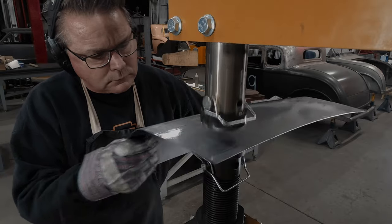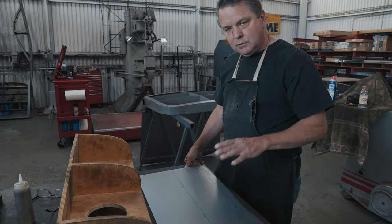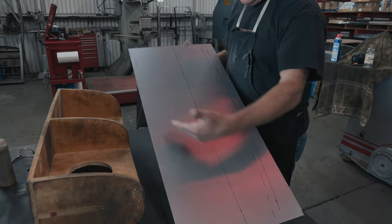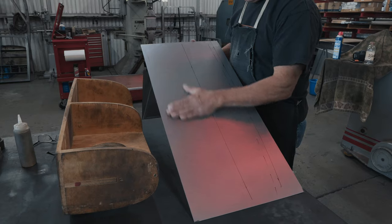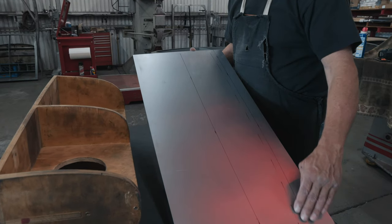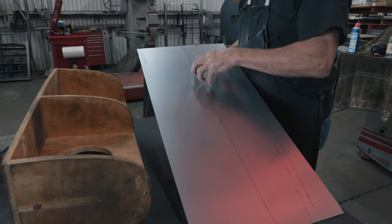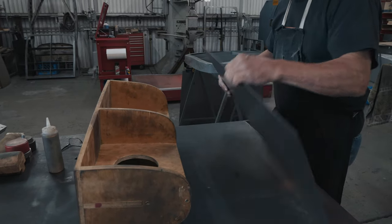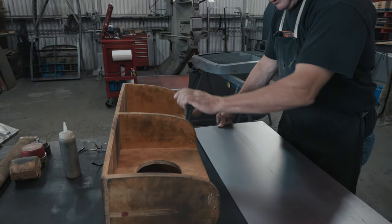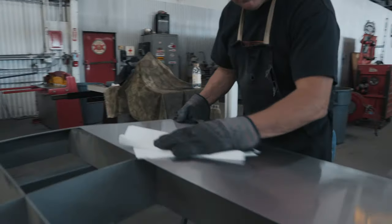Once we got it shrunk around, we had to stretch this to get it to lay flat on the buck. So what I'm going to do this time is I'm going to do a 100% stretch. I'm going to use the Yoder, and on the panel here, I measured off the buck. This is the flatter area where there's not much crown. Right here is where the majority of the crown is going to be, and then it's got to go back to being flat again. Basically, I want to have this high ridge right here blended into this, and then we'll form it over by folding it to form and see how close we are. I've got the panel marked out basically where I'm going to hit and got it oiled up, and we'll run it through there and see what we can do.